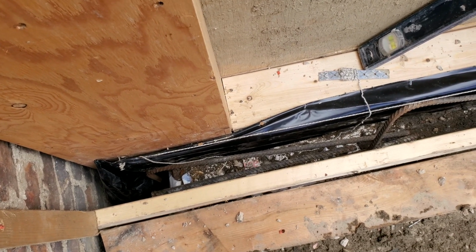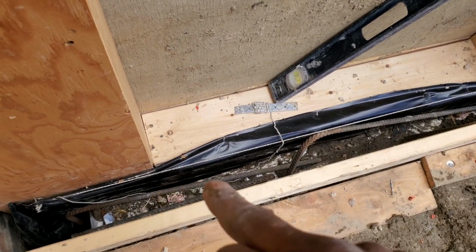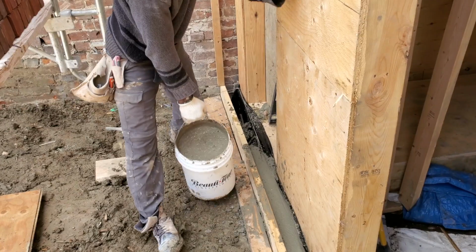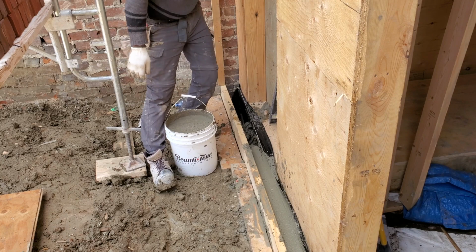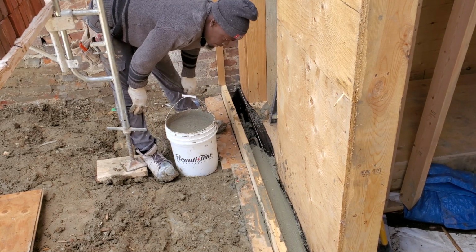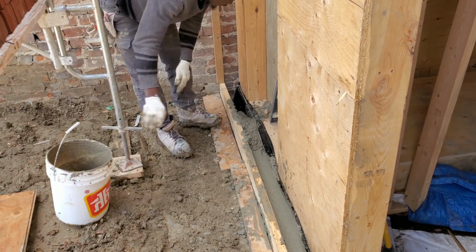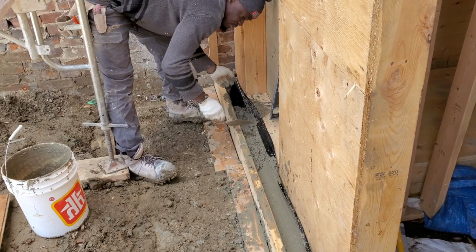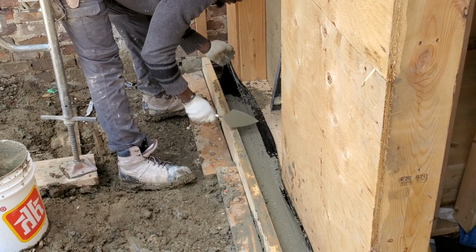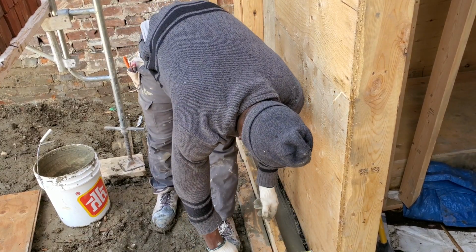Guys, so I have my rebars here. I have some 3/4 inch rebars. I'm just going to tie them in place now, pour my concrete, and get ready to start to lay our bricks. Guys, I'm using pre-mixed concrete mixed with Portland cement just to give it a bit of extra strength. From my wall overall, I have 4 3/4.